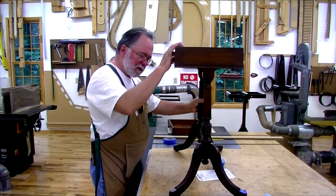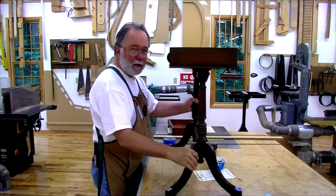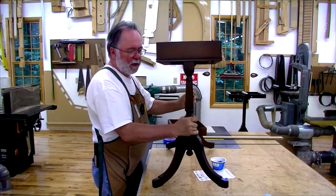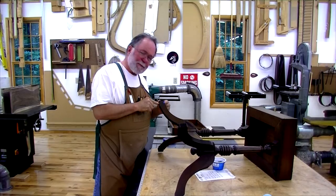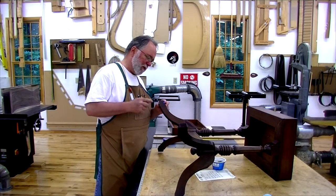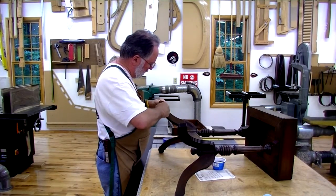After fixing these legs, it's a little wobbly. So I went ahead and put a piece of blue tape on the legs where I needed to take a little bit off. I discovered on this leg it's been shimmed up, so I think if I can just remove this leg and remove a shim or two, I'll be in good shape.